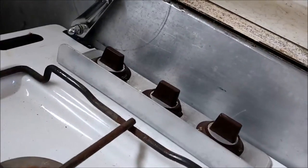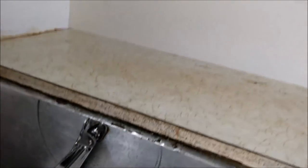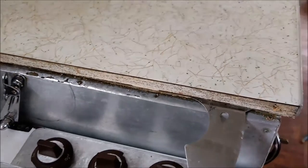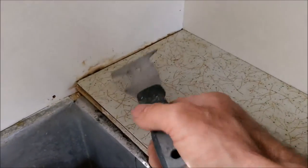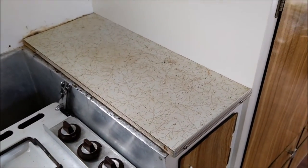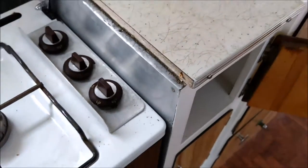I'm going to slowly pull this up. I might have to use two hands to get under there. Effectively that's all coming out nicely on this corner, but remember there's that screw at the end. Being chipboard I should be able to slowly move it out, so I'm going to have to use two hands with that. They're actually just held in by nails, and in fact there's one nail out there that completely missed the mark when they put it together. It's got nails on this edge here and along this edge here.